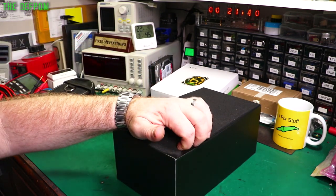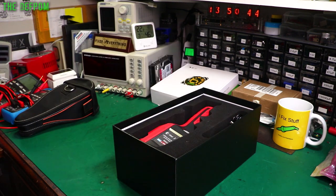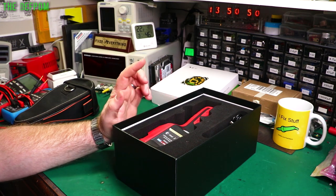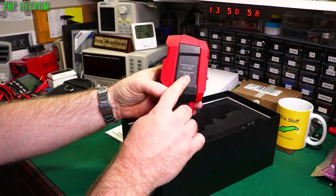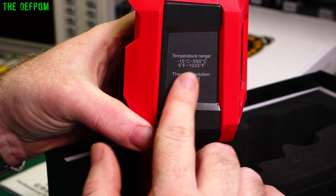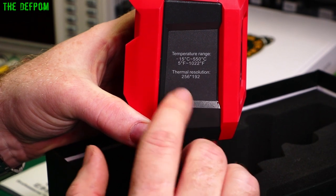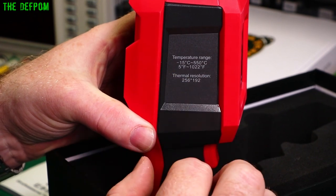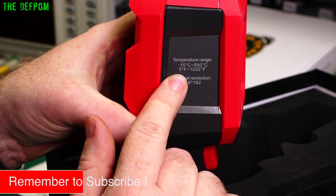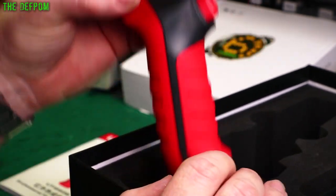This is the UTI-260B — that's the model number. It's got very good specs. It's a 256 by 192 pixel imager, as shown on the side here. It's got two ranges it can work in, and you can choose which one you want to use. You can narrow the range down for more accuracy if you need just lower range stuff. It does up to 550 degrees C, but you can lower it to 150 degrees C as the maximum, which gives you better results at lower temperatures if you don't need to go that high.